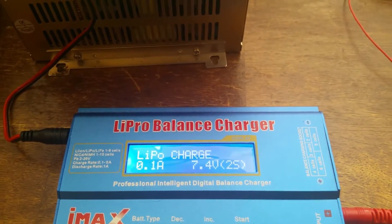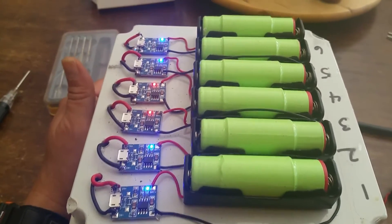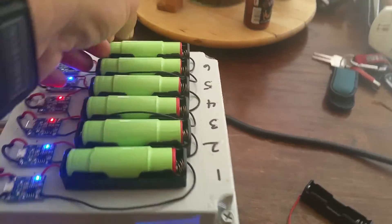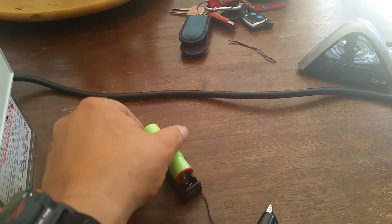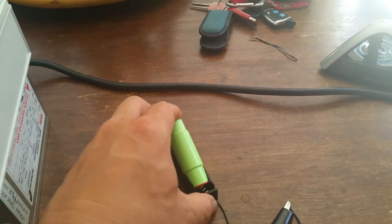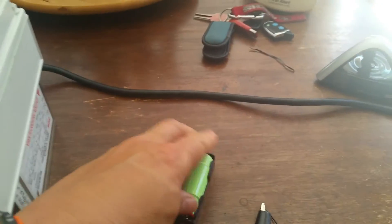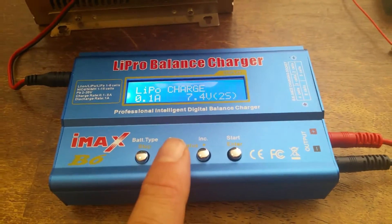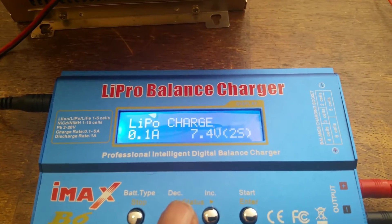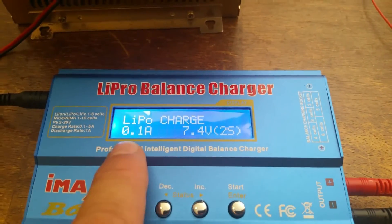As you can see, it just jumps right into the lipo charge. And you can also see that when I turn that on, it turns on my battery charger. Blue means that it's been fully charged. Now I'll take one out and place it in the cage here. When it first turns on, it usually goes to whatever the default for the lipo charge is, and as you can see right here, it's 2S, 7.4 volts at 0.1 amps.